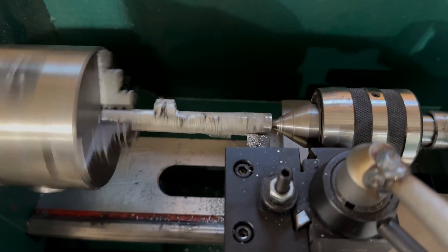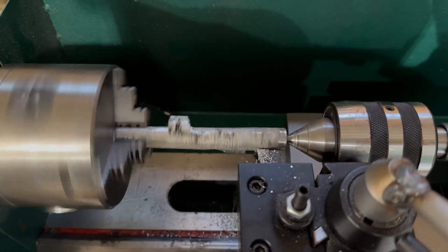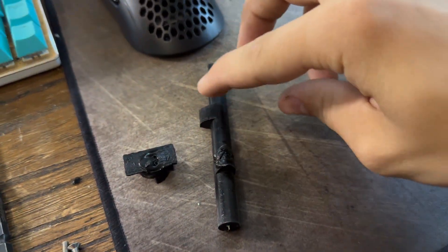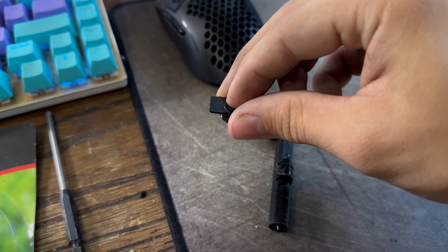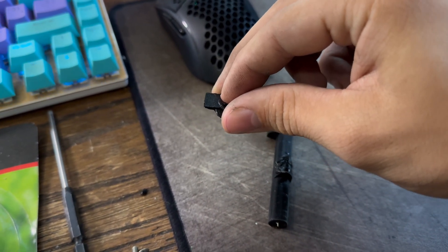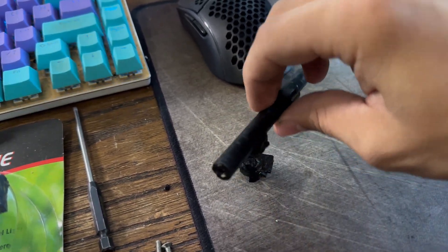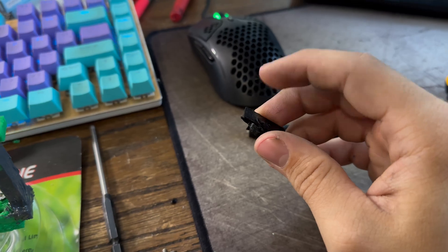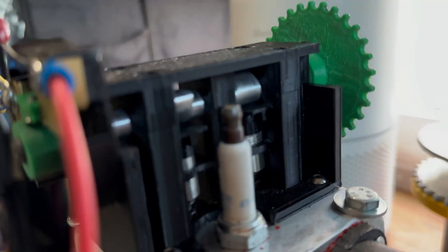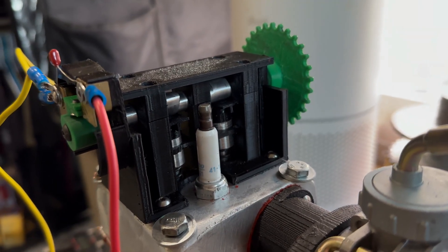I'm currently cutting the camshaft — I just cast it using my forge. There's the new camshaft installed, and here's the old one — it completely melted. I think the reason is that when the exhaust valve opens, it works against the combustion pressure of the engine, which is anywhere from 800 to 1,000 PSI. That pushes down so hard it creates enormous friction and melts it. I need a better design because if a plastic piece hits the aluminum camshaft, it could break off the valve stem.